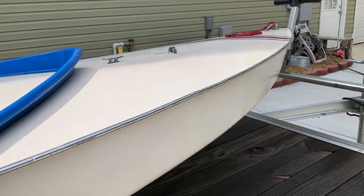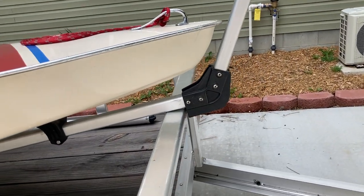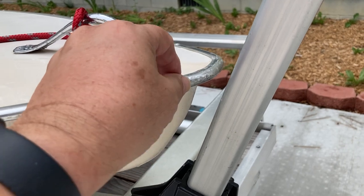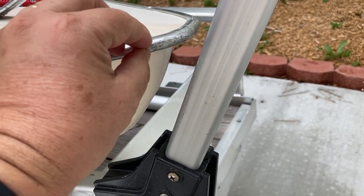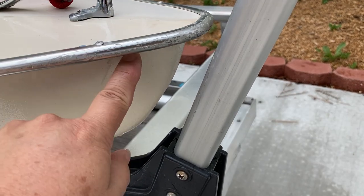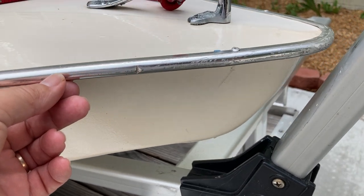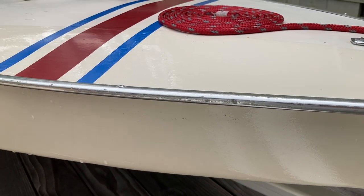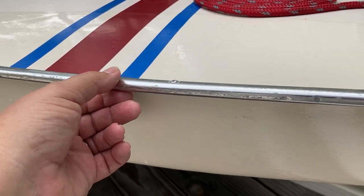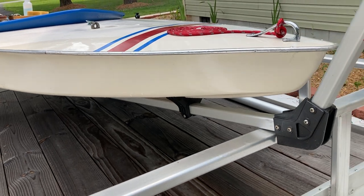There are probably a few holes I missed, and the bow up front is another area where people are always bashing into things. Enough impacts and it's going to split that seam inside — water can run under the trim and right back in through that seam. The trim is there to protect that deck-edge flange and to make the boat look prettier. We like the metal trim because it does the best job of protecting the flange; other folks have found a variety of other trims that fit, but remember that's one of the main reasons it's there.